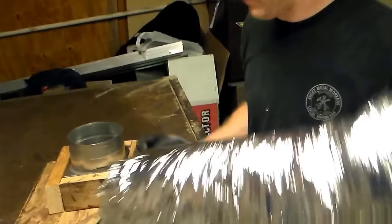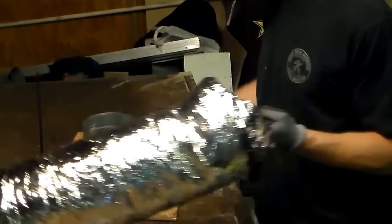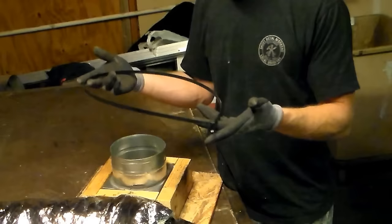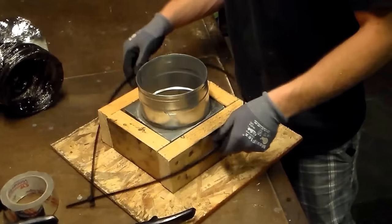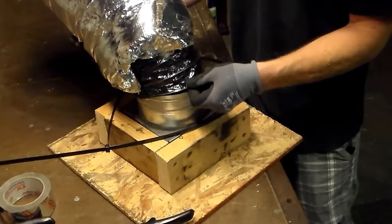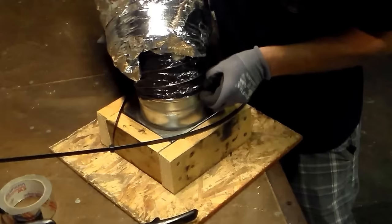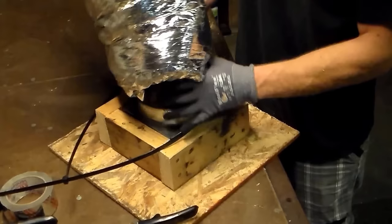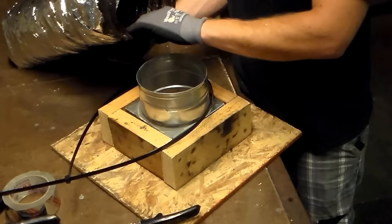So you have got your flex pipe cut and you no longer need your knife. What you need is your Panduit strap. What I like to do to make it easier is go ahead and get this thing started — it is just basically a big zip tie — so it is in reach and I can get it close to where I need it. When you are fighting a lot of flex on the other end trying to get it to go on, it is really not fun to fight with. Regardless of what I have said in the past about flanges and crimp ends going in first, flex is probably the only exception. See how it fits right over the top of that. Flex just goes on the outside — flex is just the exception.